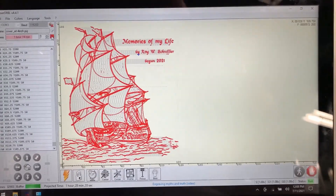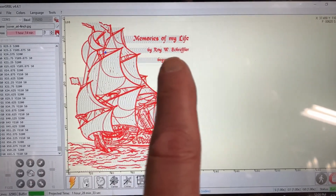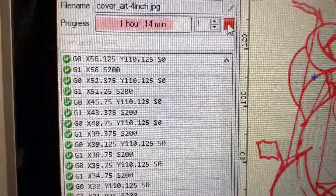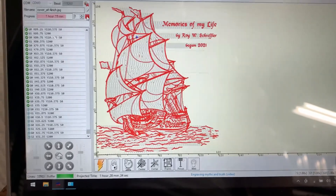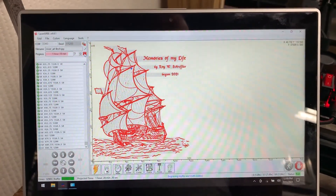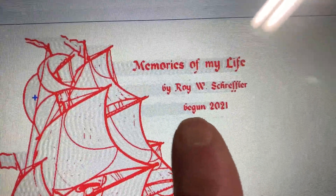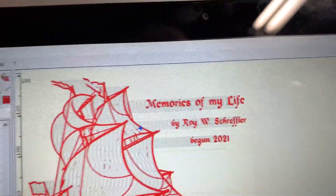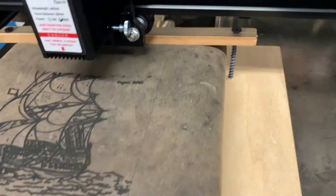Here's a shot of the software — you'll see a plus symbol tracing the line as it does its multiple passes. It's starting to do my name now. Your G-codes are flying by step-by-step; I still have it set for S200, which is 20% power. This thing would burn through the leather at a hundred percent power — I haven't tested that yet, but this thing is really impressive. I jacked up the resolution because originally there was a little bit of aliasing in some of the text. When I bumped it up, this is what you see is what you get — it smoothed out the lines quite a bit. It tends to hang on a little longer so it might burn a little deeper, so you're really going to have to experiment and play with it. I'm getting what I expected.